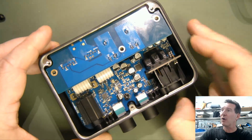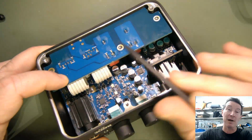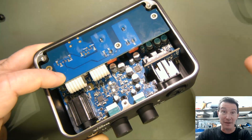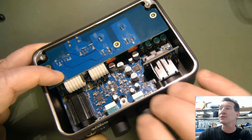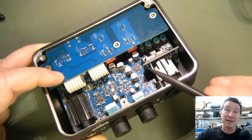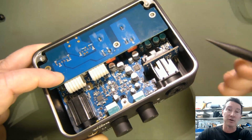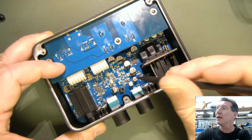But for a company like Rode, who design and manufacture a lot of different products, I'm not sure how many they have, but they would have a huge catalog of parts, and as a professional designer you should be encouraged to reuse the existing parts in your catalog. You don't want yet another reel of components, because they manufacture their own boards. They'd have their own in-house pick and place machines probably, all loaded up with components. When you design a new product, the last thing you want is to use yet another component that you've got to purchase, stock, store, put on the pick and place machines, change over, everything else. So they're trying to reuse as many parts as possible.